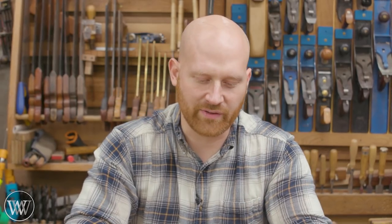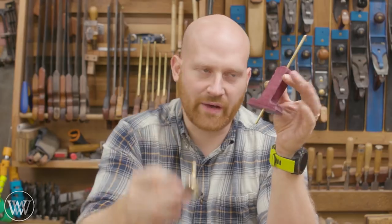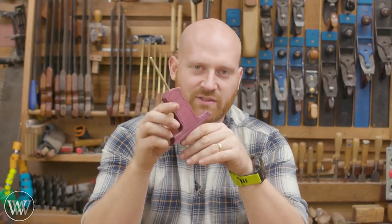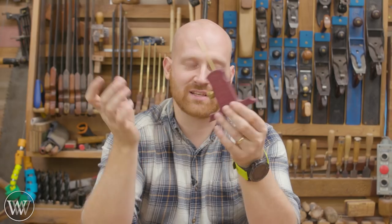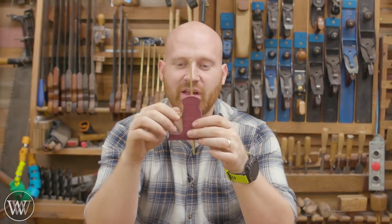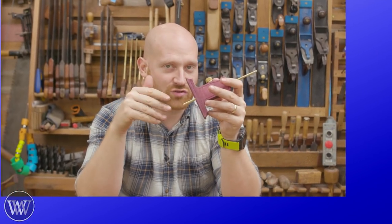So now when this one is too small I can use this one. This is far more fancy than it needs to be — it can just be a rod through a block and you've got a good depth stop, but this is kind of nice because it gives you something that is dedicated to it and it's a good chance to practice your skills. So get out, try it, have a little bit of fun. It's just a scrap piece about three-quarter inch thick and you can make it whatever size and shape you want.